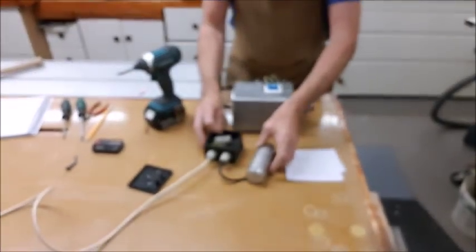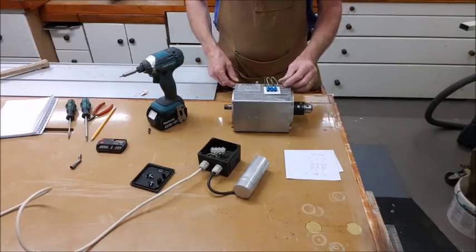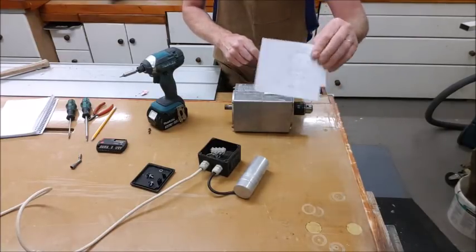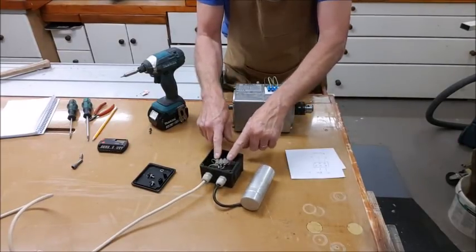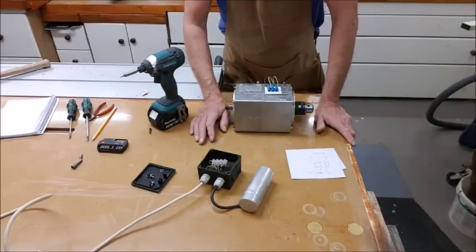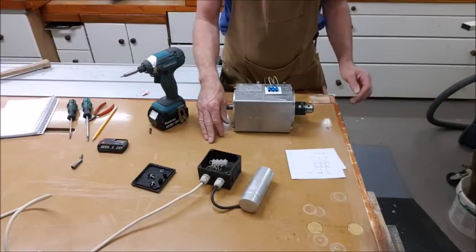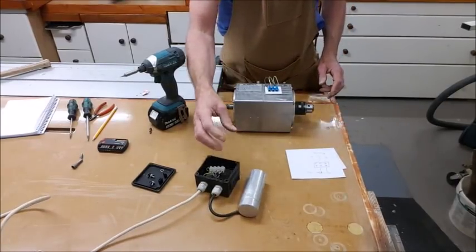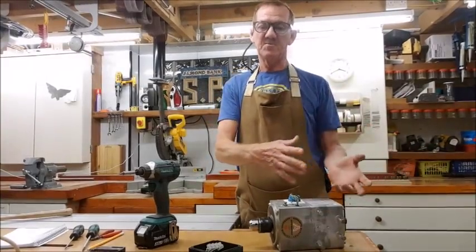That came apart reasonably easily. There are three wires coming out of the motor and an earth point on the side of the body. I've made a little note of the wiring just to make sure I don't get anything wrong. It's all reasonably straightforward — I need a four-core cable to go from the motor to the switch, or two two-core cables. Four-core cables are a little bit rarer and I haven't got one, so I'll use two two-core cables. They can be mounted separately and I can just run the thing from here. Now it's a matter of positioning it and getting the bench side ready to mount this into.